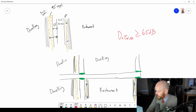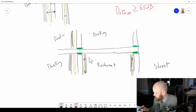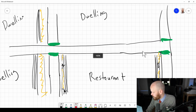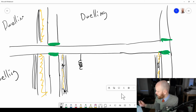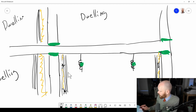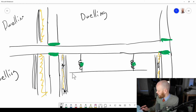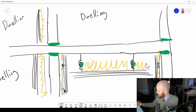And that one is preferably solved with, maybe we can draw it in this one as well. If it's not too small. Well, that's the beauty of it. You can zoom in a bit. Some kind of extremely powerful acoustic hangers here, I would say. The spring hangers are probably your best bet here. And perhaps those ones that are both elastomer and, I don't really know how to draw them, but there are products like that that are very good. And let's say go for a triple layer gypsum, mineral wool in the cavity.